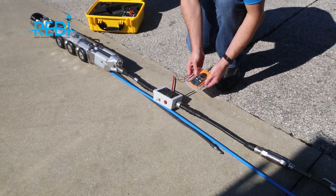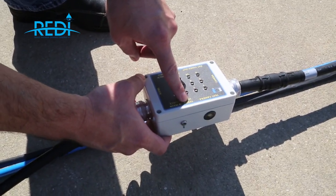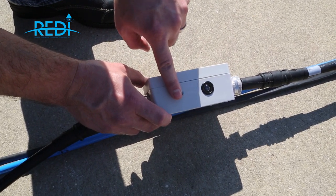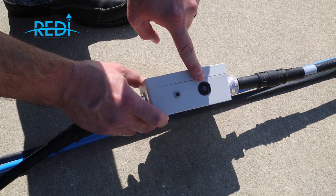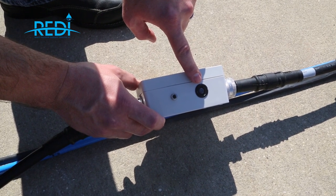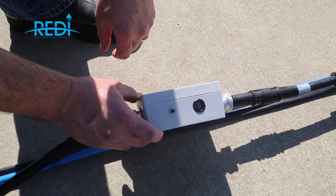Any problems within a transporter or a camera that are pulling voltage down and causing a problem can now be detected easily. Another feature built into the diagnostic box is a small miniature camera. If you suspect a problem with your mainline camera, you can flip a switch and get video from this secondary camera sent up your TV cable. So if you only have one camera and can't tell whether you have a cable problem or a camera problem, this will help — you may not need to get a loaner to diagnose the issue.